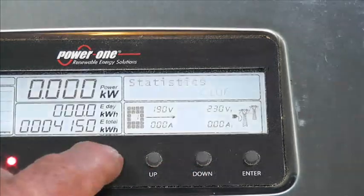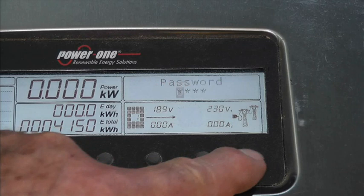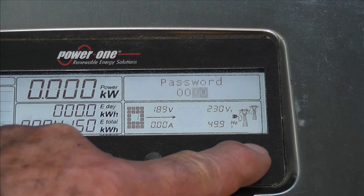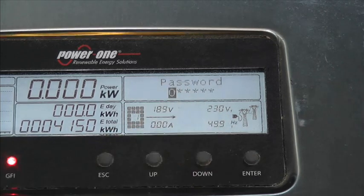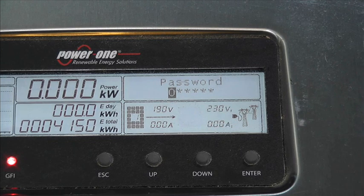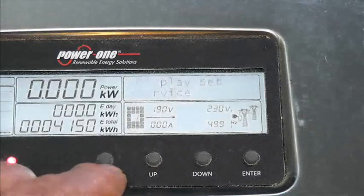However, this video really is about the fact that - let's go escape, down, enter settings, 1-2-3-4, then down - you can get the service password. I'll put a link at the end of this video to Mick's video on his channel, Buy It Fix It. Hopefully you can get in there and switch off the ground fault sensing. And if not, see the rest of his video where it shows how to connect a laptop to one of these.